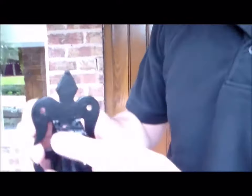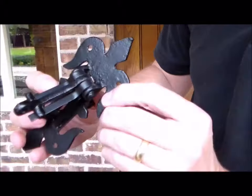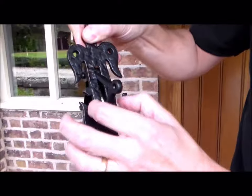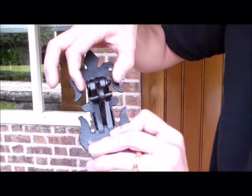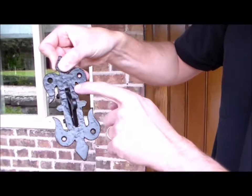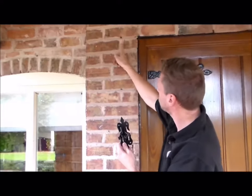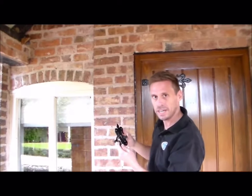The width of the back hinge section is generally about the same width as the middle section, so you need to chisel very accurately to make sure the width is just right — wide enough to fit the whole back in but not so wide that you can see a gap behind the brickwork. Score the brickwork first to get a clean start, then begin chiselling. Use a bolster chisel and hammer to create a sharp, clean edge.